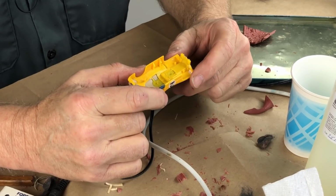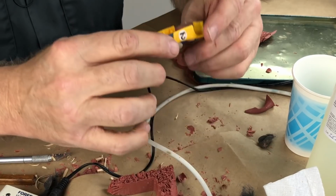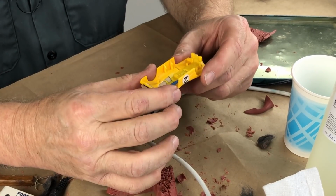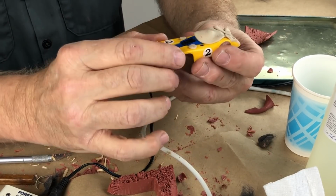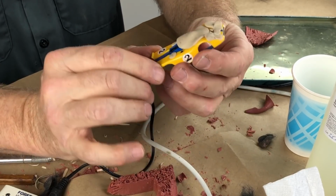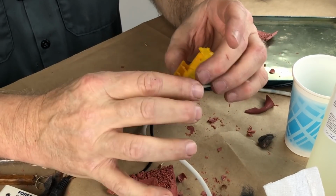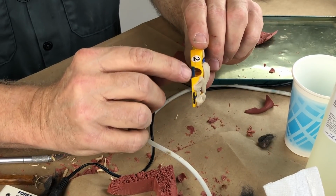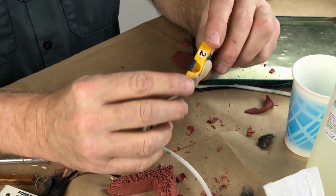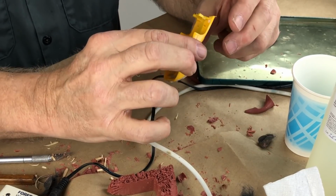While you were out fooling around and living your lives, I was busy making a mess here. As you can see, I have the car body all clayed up and ready to go. You can see the exquisite craftsmanship of my clay job. But the only surfaces that I care about are the interior surfaces. I added a little bit of a sprue. This is just a channel for air, because that fender right there would catch air in my design of this mold.